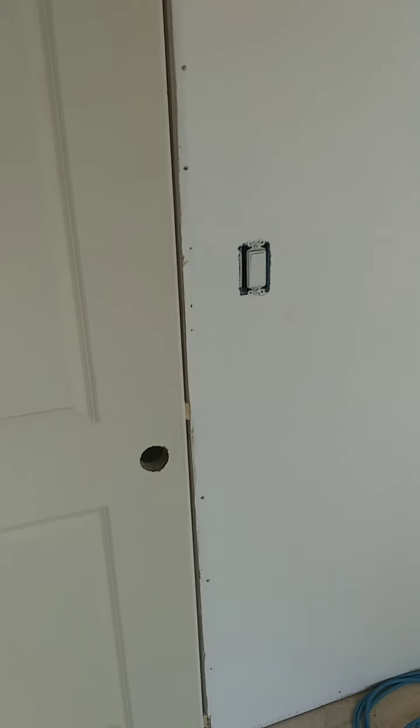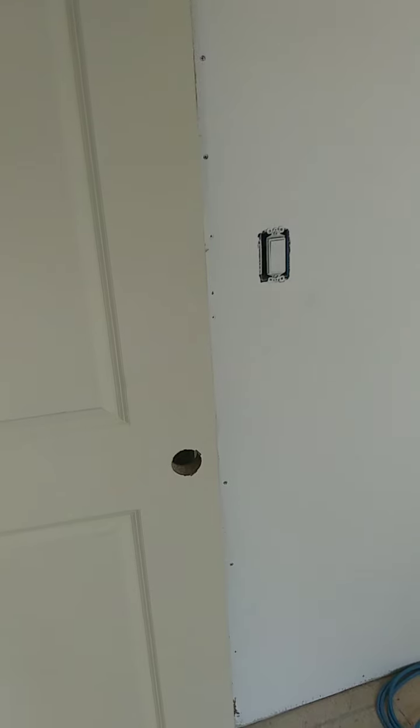I went around and shim-shammeried it out, then screwed it off. Now I'm going to cut my shims off — you can use a knife, but I'm using a multi-tool because I own it, so why not? And shazam — smooth. I'll get the latch on it. That's interior doors, ladies and gents. That concludes episode 27 of Trade Secrets for Homeowners. Please like, subscribe, and ring the bell. I'll put a link to my PayPal account in the description. See you all next time.